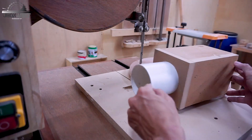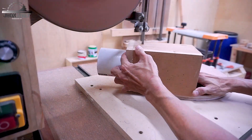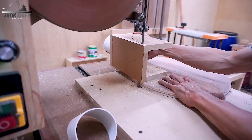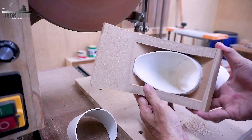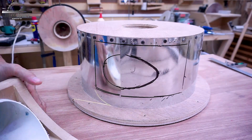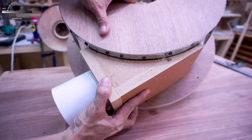Why I'm using three inch, I will explain later. Now I'm going to cut this intake using the circle jig and the template I made before - those six circles I made. Already done. Now we're going to attach this and make a hole in the cyclone head.